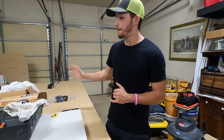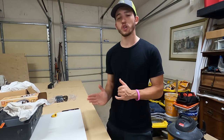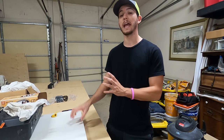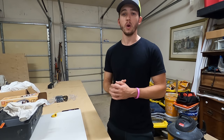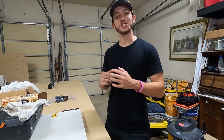When we got back to the house we unloaded all of the materials and our first step of this build is to cut the sheet of plywood in half, because the leg design that we're going with requires us to laminate this sheet of plywood and double its thickness and strength. We're also going to be designing the legs and see how those take shape. So let's get started.